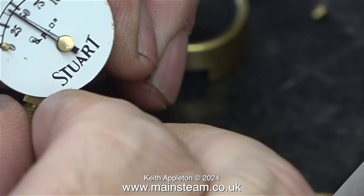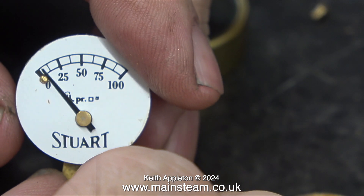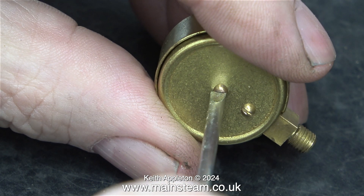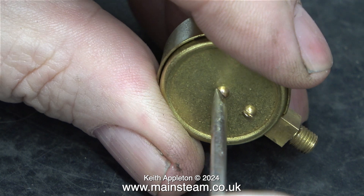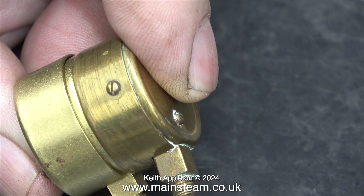When I look at this pressure gauge I think I know what's wrong with it. Someone has tried to dismantle it in the past, removing the front part and rotating it. This then bent the Bourdon tube inside so the pressure gauge needle was never going to be in the right position. I re-bent the Bourdon tube and reassembled it — it's not quite right, but it's like the other one now. I'm actually going to buy a new pressure gauge for this boiler, but for the moment I'll use one of these.